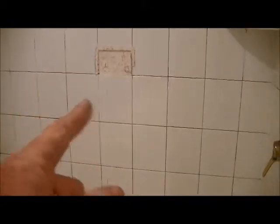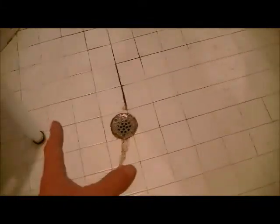All this tile will come out, including the ceiling and all the walls, and this is the old 20-year-old construction method. So inevitably there's going to be a wire mesh with the concrete embedded in it, and then the ceramic tile, which is never a good idea in the shower, on top of all that. So you've got probably about 1.5 to 2 inches thick of this wall in order for all this to come out, which is a good part of a ton of material, including the shower floor, which is probably 500 pounds of shower pan that was poured in here.